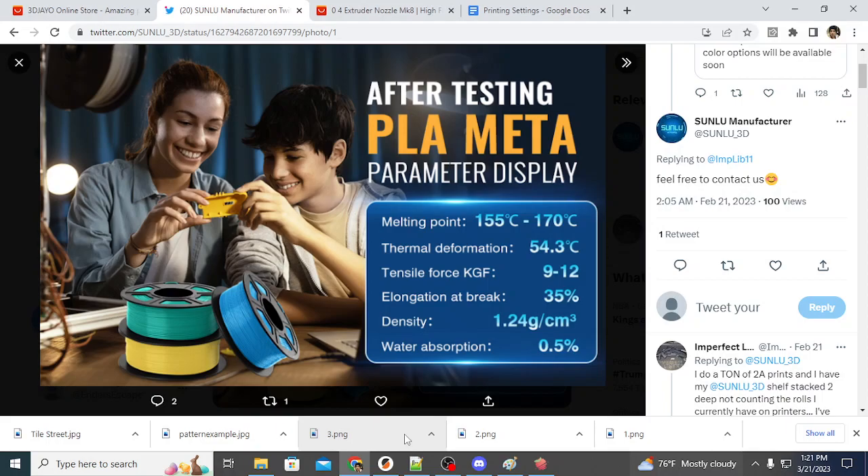One next point of it having such a low temperature to melt is that if you were operating a print farm, heating the nozzles takes energy. The less energy you have to put into heating the nozzles, the better — your silicone hot sock doesn't have to work as hard, and ultimately your electricity cost will be lower. That might not make a big difference on one or two printers, but if you're operating more than 20, 30, or 40 printers, those energy savings could be significant.